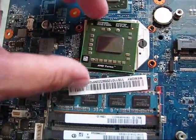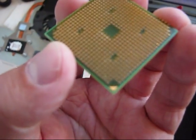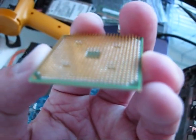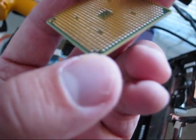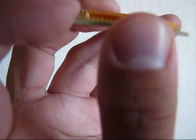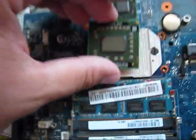I wasn't able to install it from the first time. I don't know how the CPU was pulled, but some pins are bent. As you can see, right here. The camera cannot detect it, but this pin, which is located right here, is bent. It was incorrectly pulled out from the slot of the motherboard. You can see it from here. I will use a screwdriver and then align it properly before I install it into the socket of the motherboard.